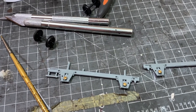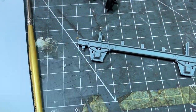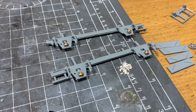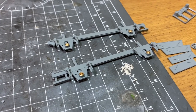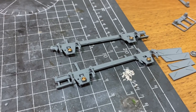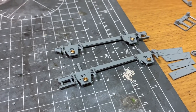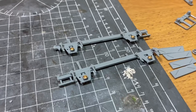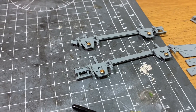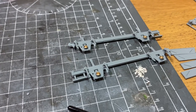I'll move on to the brake hand wheels — they go on to the brackets just here, a small little bracket. The brake shoes are now in position and I've used a bit of plastic magic, which seems pretty good so far — not a product I've used before but fairly happy with how it's going on. I'm using the time now to basically prime the brake handles; they're going to be painted white, whereas most of the rest of the underframe is going to be black, so I want to make sure they're painted before I put them in position. The next job is to put the chute together.